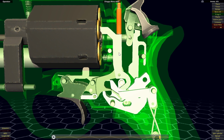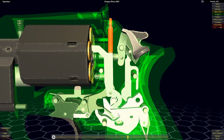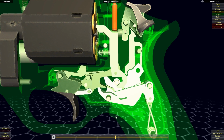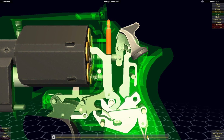And that's why the hand is doing that, because usually speaking, when you're cocking back the hammer, you're going to be bringing the hand up. So they're just utilizing that upward motion to activate this pin. Now, an interesting side effect of this is when you pull the trigger in double action mode, the pin will come up just the same as it does here, because the hand will still contact it all the same. It just will drop right back down as soon as the hammer comes forward.